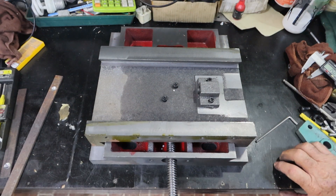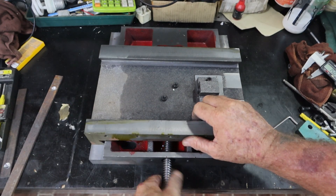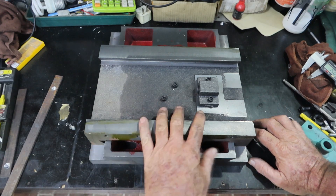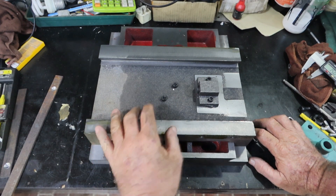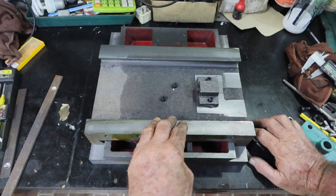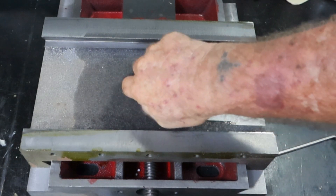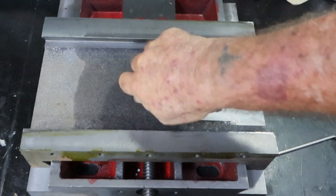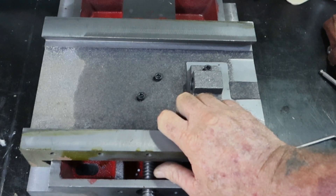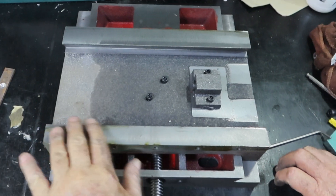Well, I had a hell of a time trying to get this apart. I was trying to lift everything out and get it out that way — couldn't do it. When you take the lead screw out — which is a left-hand lead screw — you can't slide it off because it sits down inside. Eventually I thought, let's try getting the x-axis off first, and once I took the lead screw out of there it came straight off. Good news: I'm not going to have to replace these lead screws, because all that slop in the y-axis is right there — can you see them moving? Just slopping around. Once you tighten them up there's almost no slop in it at all, you can even finger-tighten it. This one's tight though, so there's a little bit of slop in the x-axis.